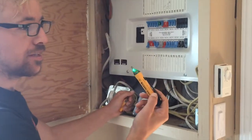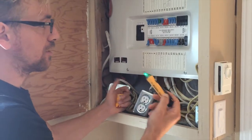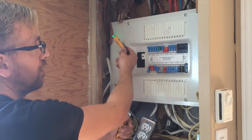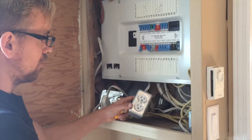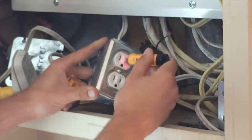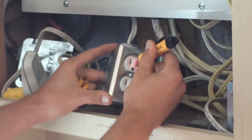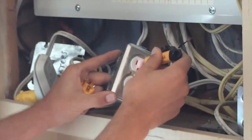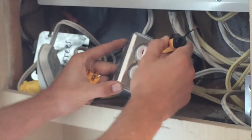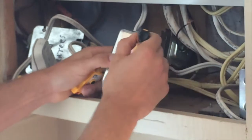There are some cables it won't read through — some of the older ones it won't read through. So you can't always trust this as an accurate representation. It also works well with a non-tamper-resistant receptacle where you can shove it in and leave it there, then go to the panel and shut it off. It makes a pretty loud noise, so you can also go to the panel yourself and shut down the circuit. That's a really good one.